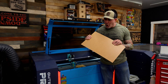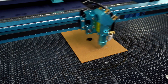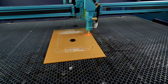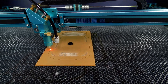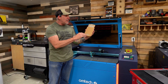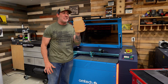All we need to do now is cut the front piece. We're using some 1/16-inch clear acrylic — I'm gonna put a nice raster on the front and then give it a nice vector cut. I left the paper on the front of this material and just hit it really light — going for a frosted glass or etched look. There are a lot of different tips and tricks depending on the finished look you're after. We're gonna take this over to the table and clean it with a little alcohol to confirm that's the exact effect we're looking for.